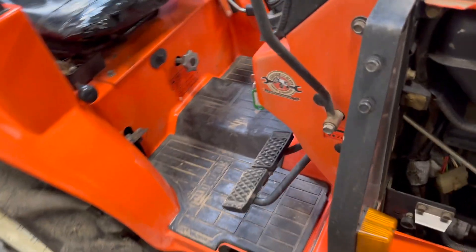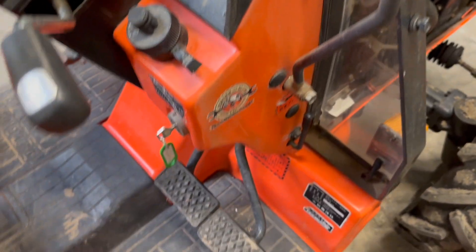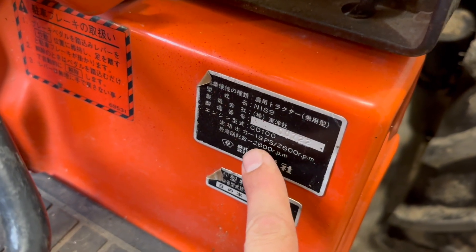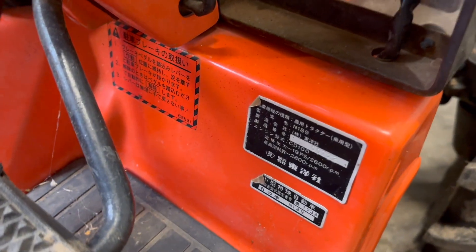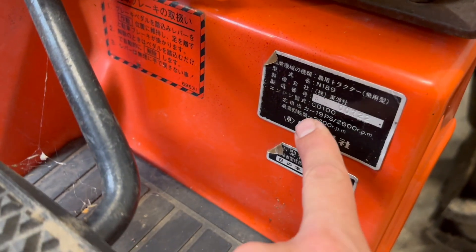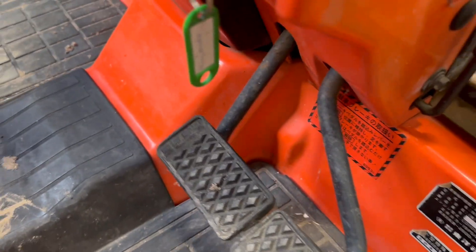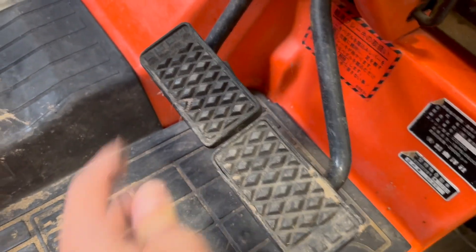Now we are on the other side of the tractor. This lever is for hand throttle — important to know. And here is the foot throttle. Of course, here's the chassis number. It says 19 PS — that's on the PTO. Most of the time the engine brake horsepower is a little bit higher, like 2 PS more. It has 19 PS at 2100 RPM. This is of course the brake — you can split them so you can use the right brake and the left brake independently.